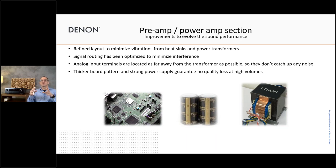To feed everything, you need a strong power supply and high-quality main capacitors and block capacitors — that's where the energy comes from when you drive your speakers with impulses and heavy bass attacks. Overall, it's about getting the best performance from your digital or analog input signal all the way to your speakers. The best performance comes from doing as little harm to the original audio signal as possible — ideally, the product should act like a wire, passing on the signal unaltered, and just increasing the level to drive your speakers.